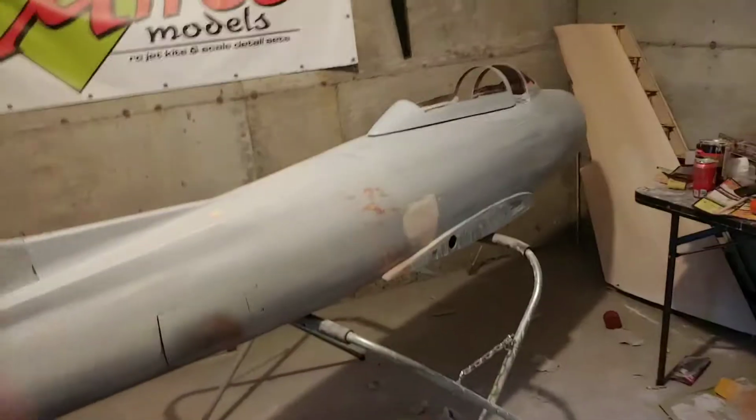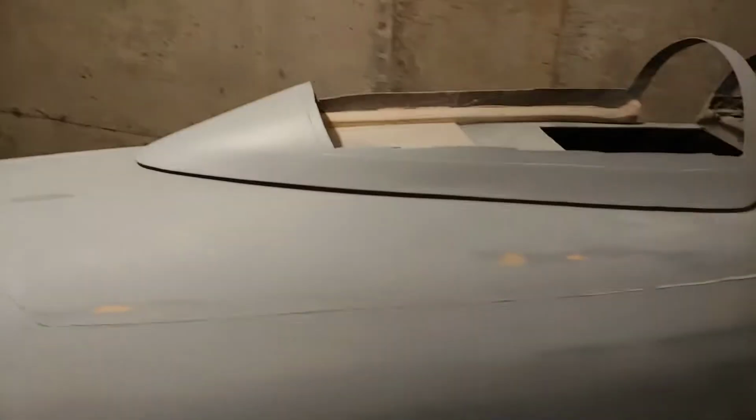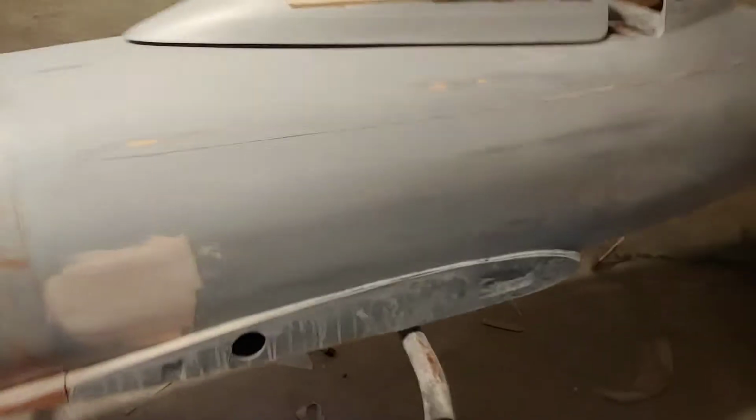And one thing I emphasize is don't try to get it too straight. You're going to see little shadows and things like this, but I can assure you that this is not final sanded, and you want to reach over and look and get down to these things and do it. And you can always take, excuse me, I swallowed wrong. Anyway, you can take things and wipe them down with water, and the dust will deceive you. So this is what you've got to do in order to get it. You're going to see little spots like this, but they will come off and they will deceive you. So don't be deceived by dark and light.